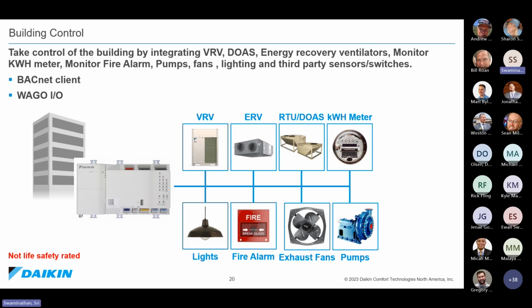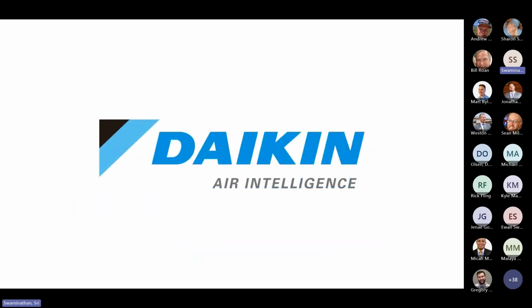And from the Pro Edge, it's not only just controlling a VRV system, it's actually designed to control third-party systems as well. You can connect our ERV systems together. You can connect our DOA systems in the Pro Edge, kWh meters, lighting control is possible, exhaust fans and pumps. All of that can be controlled by the Hero Pro Edge.